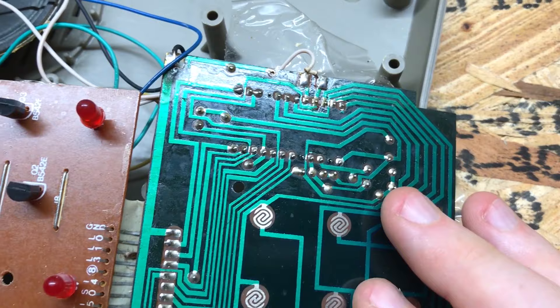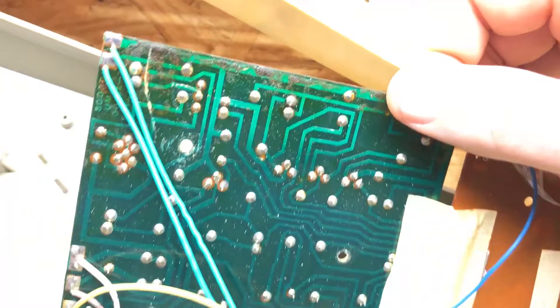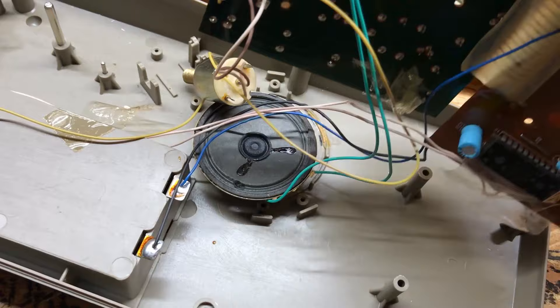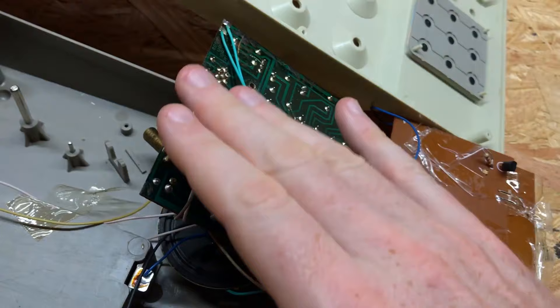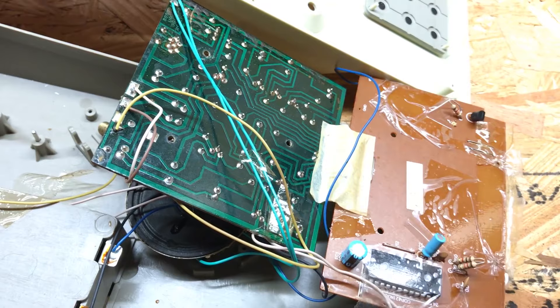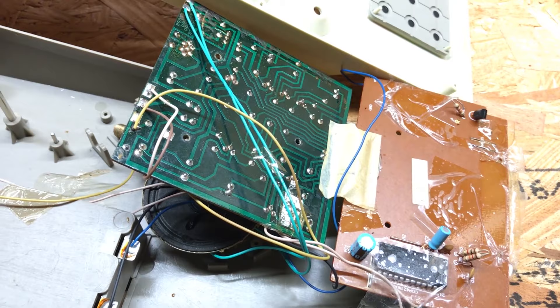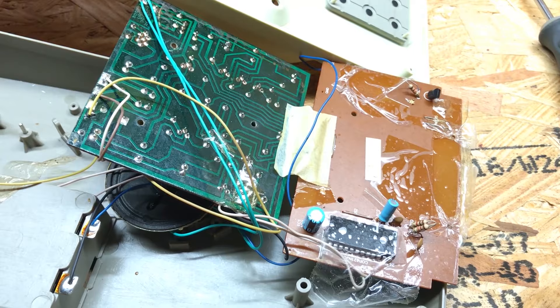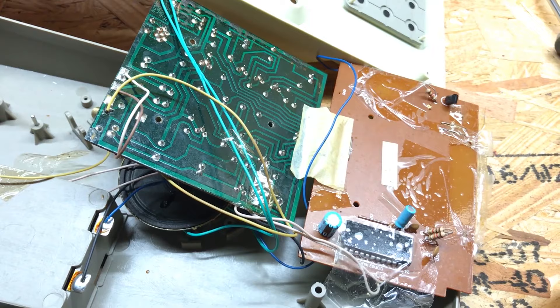I still see some concern here — it just doesn't look great. I'm going to get the flux and reflow a lot of this solder. These blue wires go to the speaker, and that's really concerning. It could be a situation where that's bad, and who knows — if it's some kind of issue with current draw, between the motor and the speaker being the two highest draw items, a bad connection could pull the voltage down and cause the chicken to go haywire or affect the logic. On these old electronics it's kind of just a good idea to reflow the solder anyway, because you'd be amazed how many times that alone will fix weird problems with old toys.